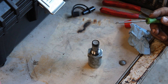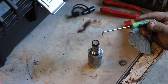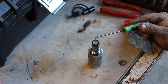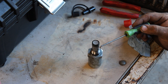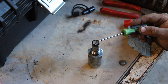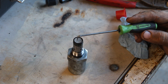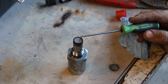When you pull this IPR out, the first and most obvious thing to check is the condition of this contaminant screen here. This theoretically keeps large chunks from entering the valve — which is technically a solenoid. Check it for any kind of abrasion, if it is pushed in, if it has any small or large holes. If it's damaged, the screen needs to be replaced at minimum.